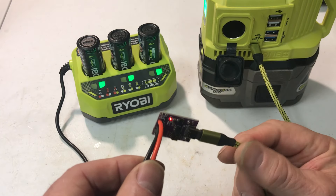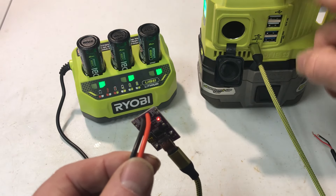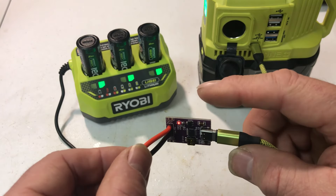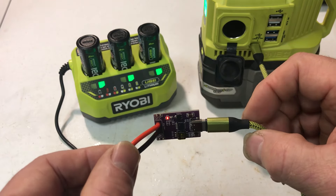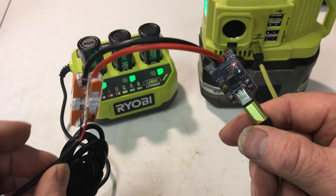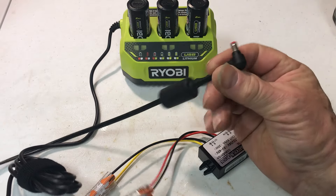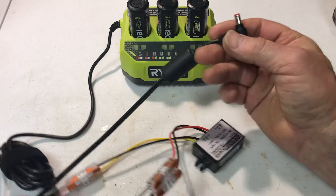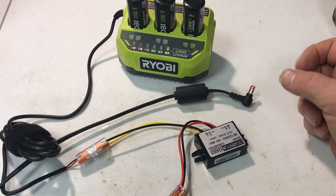You might want to charge the batteries using a Type-C power cord. In this case again I'm using the power source as the test, but these little decoys you can get will output 5 volts at a couple of amps, so you can also run it this way. Again I'm using the lever nuts to connect the cables. I also wanted to be able to use the direct DC output of the solar panels, so I used the same DC to DC converter and that works pretty nicely too.